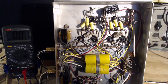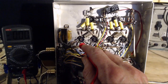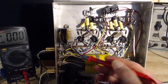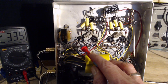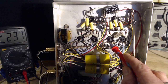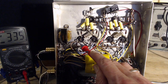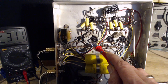Voltages, plate voltages. Everyone's asking, what are the plate voltages? Remember, the cool tube plate was running a little high. This is the cool tube. Cool tube plate voltage, not on the 20 volt scale. Cool tube plate voltage, a little more visible. .335. Now watch the rest of them. Plate. .310. Oh, .325. .320. 35. So, you know, that's 20 volts difference there.